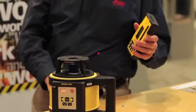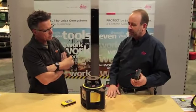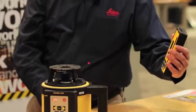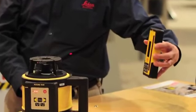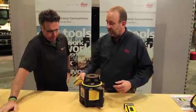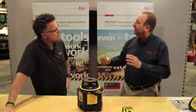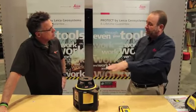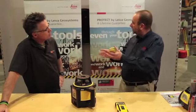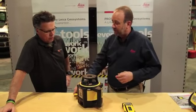It's got a visible laser beam, but outdoors it's really tough to see the laser. It doesn't matter how bright or what color it is, they're hard to see outside, so this acts as your eyes. Photocells here will pick up the laser and give you the relative elevation. And then it's got a remote control. The remote control is designed to give you full functionality, so one person, even though you're not at the laser, has full functional control over the laser. If you want to change the rotation speed, stop it and move the beam to a specific location, or scan it — everything can be done by the remote, which just fits in the pocket.